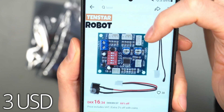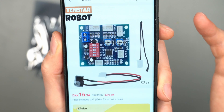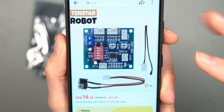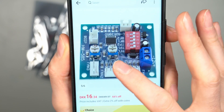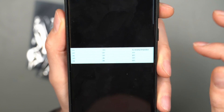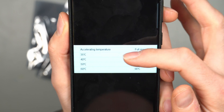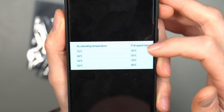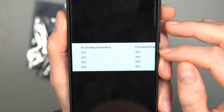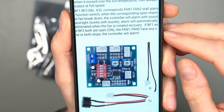The second one actually has three PWM fan headers, a dip switch, and a beeper - so it could alert you if fans aren't working or if temperature increases. The thermal probe is a bit shorter. There are also some screw points for adjustment. The dip switch instructions show TP1 and TP2 settings: it starts accelerating at 35 degrees Celsius and runs at full speed at 45 degrees, or you can change the range up to 60-90 degrees Celsius at max temperature.